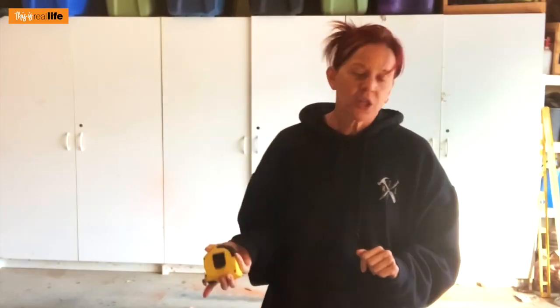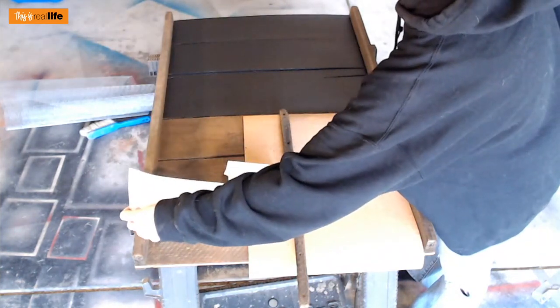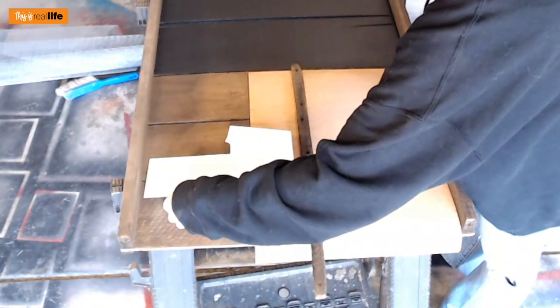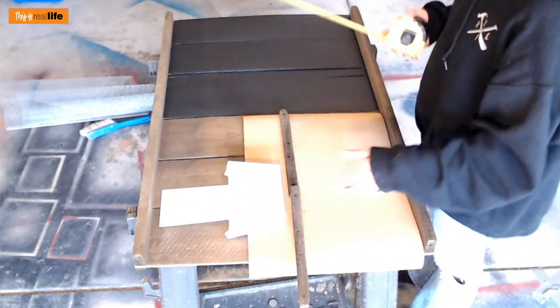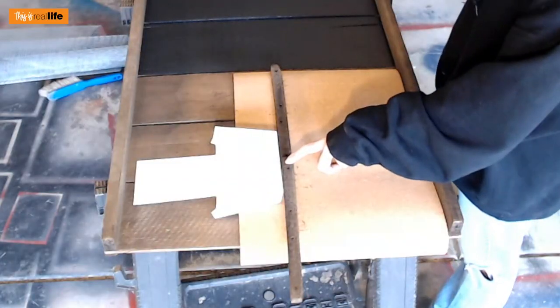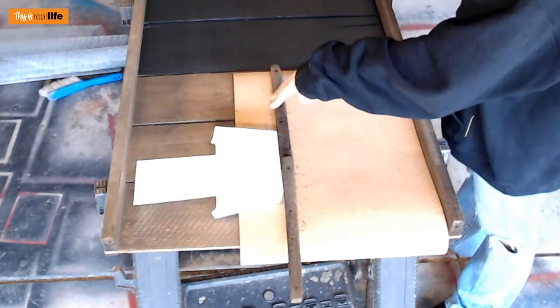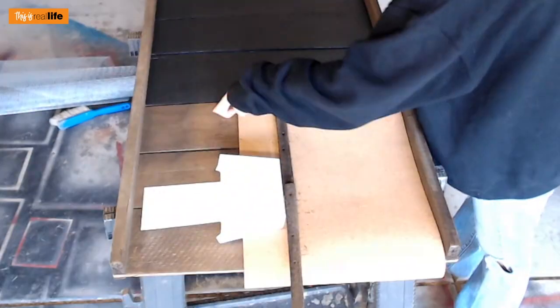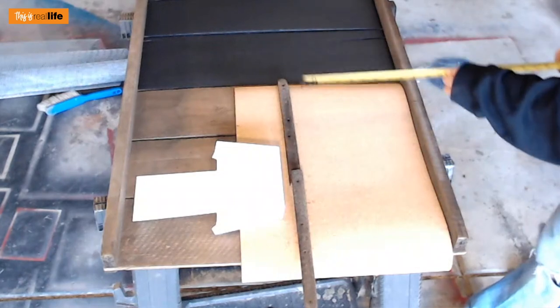While waiting for the chalkboard side to dry, I played around with proportions on the other side. I traced an envelope to see how easy it was to slip mail in, and the mail cubby needs to be at least 11 inches from the top to fit envelopes. The inside is about 22.5 inches so I could split it in half at 11 and 11. I thought it would be cute to use these wood edges from the clock tray as a border, and I'm thinking four hooks for keys. So the top of my border will be at 12 inches, leaving 10 inches of corkboard room.